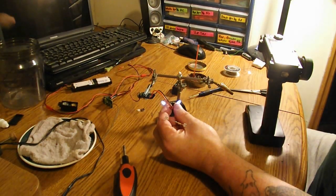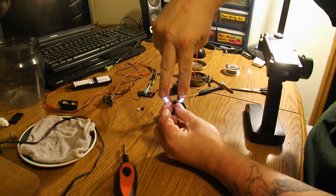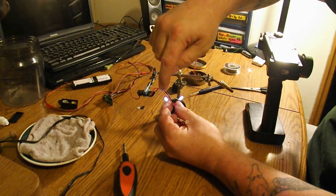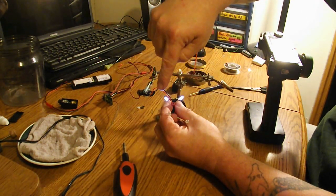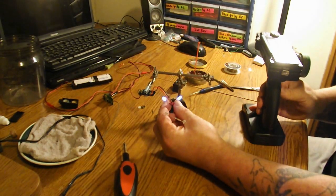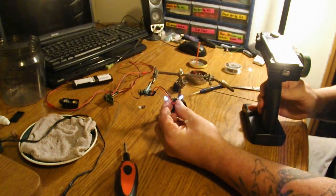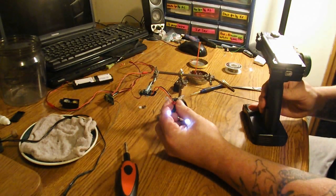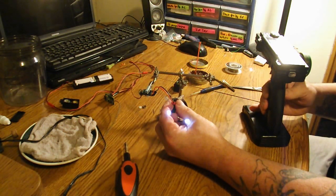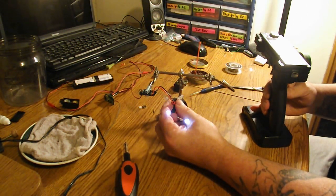As a further experiment, I just put these two lights in with reverse polarity to these, so these are positive to positive and negative to negative, while these are positive to negative and negative to positive. Now I can make the switch alternate between the two sets. So all you have to do is reverse the polarity and you can actually have two completely different circuits of LED lights that are independent of each other, all controlled from the channel 3 button on your controller.